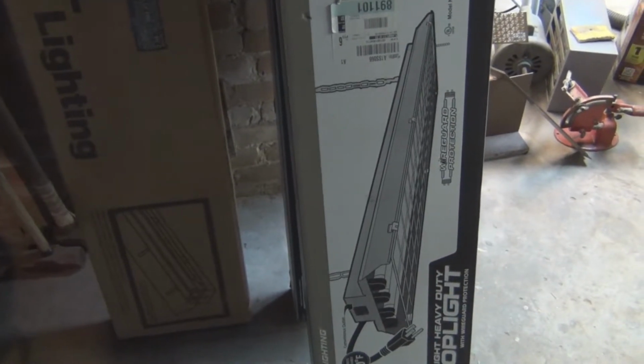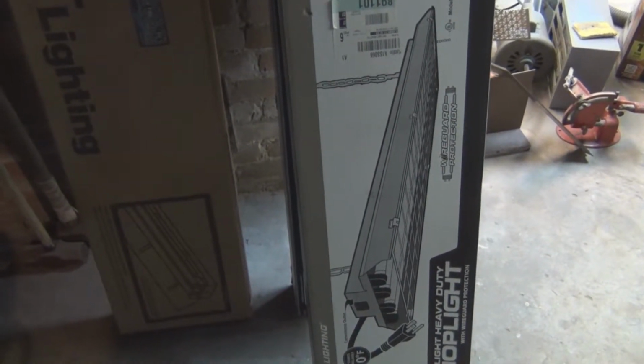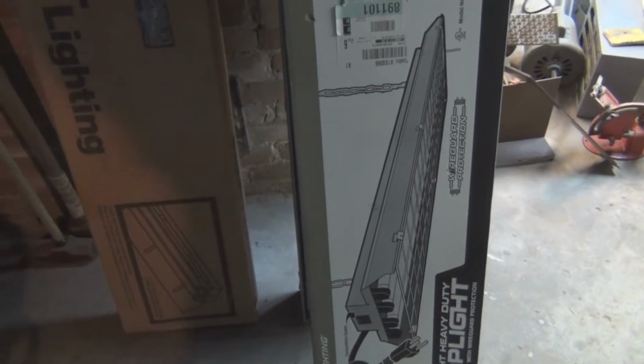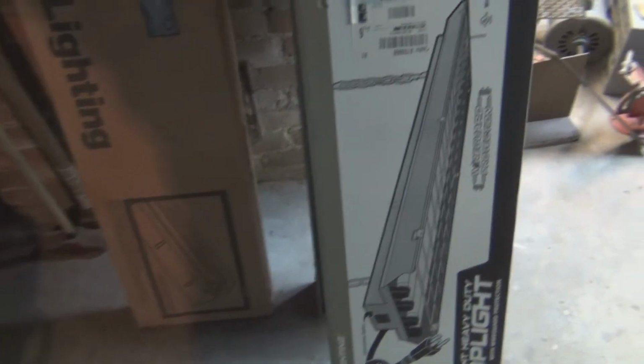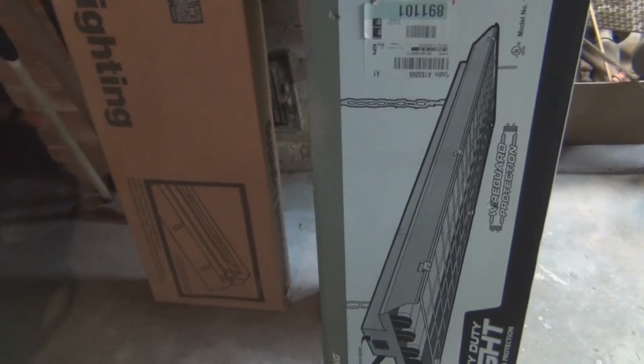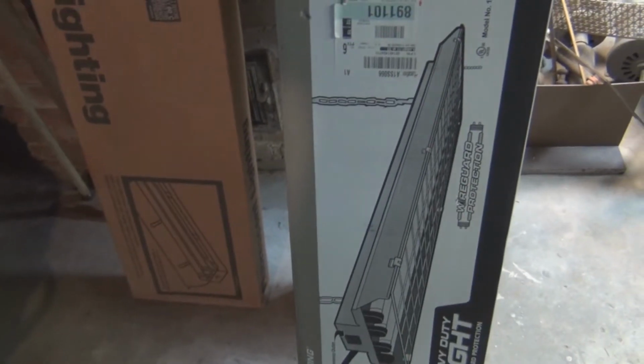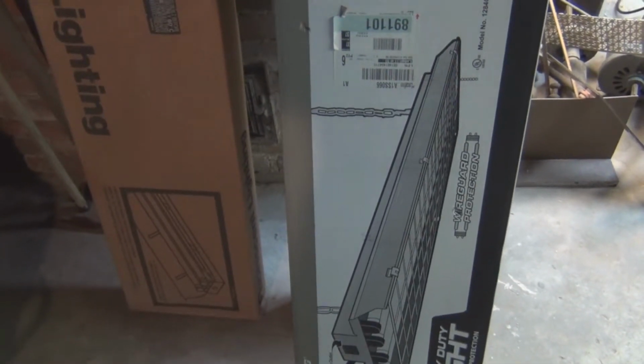But the whole point of that is energy savings, and if you're leaving the ballast in there, you're losing energy and warming up that ballast, which you're really not using. And so the other route is you rewire. You keep the fixture, but you rewire the whole thing and you remove the ballast.